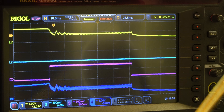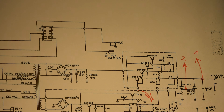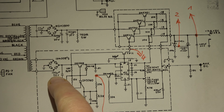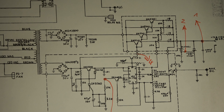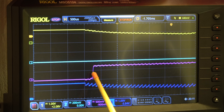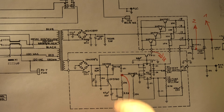Of course I have to check the polarity — plus, minus, plus, minus — and this is the correct orientation. Now I will switch it on and feed in the clamp meter. Here we have the receive current: 2.06 amps. When I switch on the electronic load, one additional amp — then we have three. The color changes when a certain current limit is reached. I will add 2 amps more as additional amps.